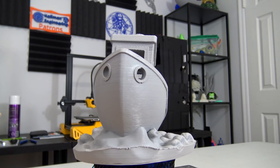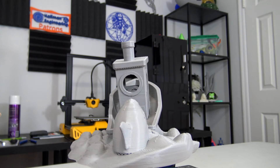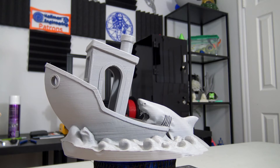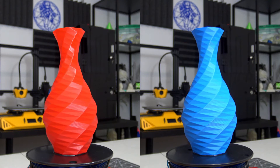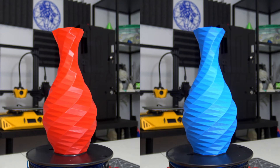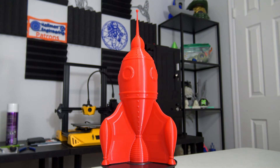Larger layer heights are no problem. This Jaws Benchy was scaled to the largest that could fit on the print bed, printed at 0.3mm layer height at 80mm/s, and took just under 15 hours to print 312 grams of filament. And it looks great. Unsupported overhangs like the shark's jaws showed the expected drooping, but considering the speed and amount of filament being extruded, it shows this printer doesn't shy away from larger prototype prints. Finally, the Artillery Hornet prints spiral vases beautifully. The layers are nice and consistent, and it works straight from the SD card with no configuration changes needed. I scaled up a spiral vase rocket to 250mm tall and the Hornet had no problems, even managing the top of the antenna with minimal drooping — those dual cooling fans ensured the filament had enough cooling.